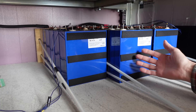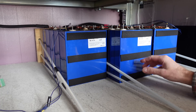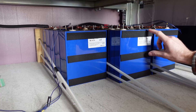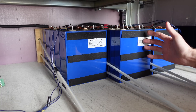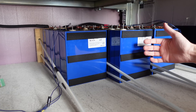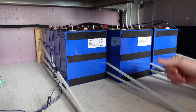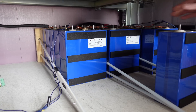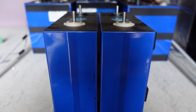First up, I want to show you what these batteries look like that I'm pulling out. I've removed a number of these batteries already. When I built these, I used three strips of neoprene high-density foam between the cells — 1/16th inch thick foam. The idea was it would allow the batteries to naturally expand and contract whether at empty or full state of charge. They are kind of stuck together a little bit. Let's pull out two of them — look how nicely these batteries still fit together, it's a perfect fit.